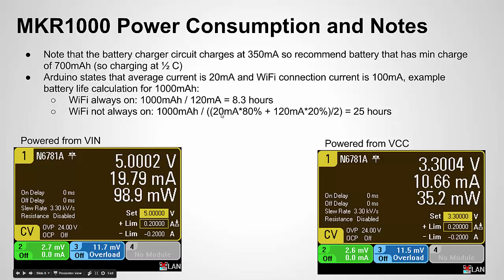There are also levers you can pull on the SAM-D21 microcontroller chip that can probably get you way below 20 milliamps. So maybe I'll do some future videos on how to get this down to a lower power consumption so you can get much longer battery life.